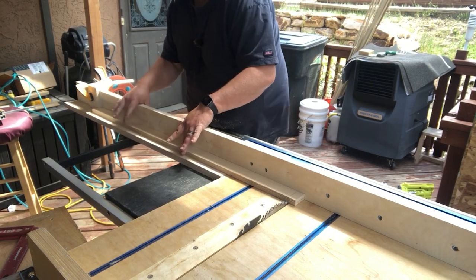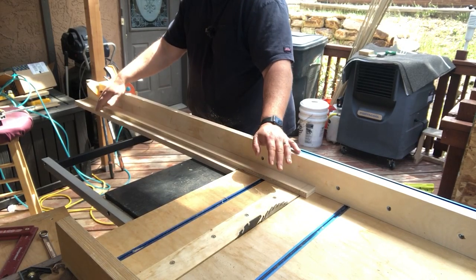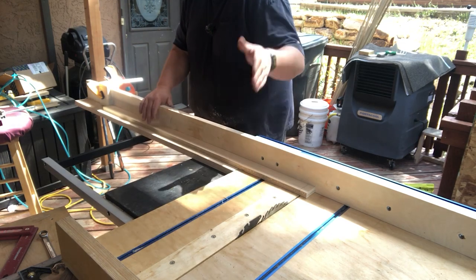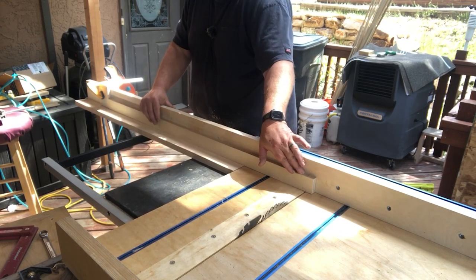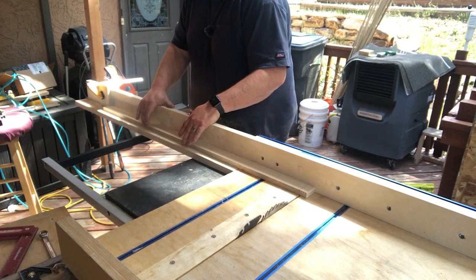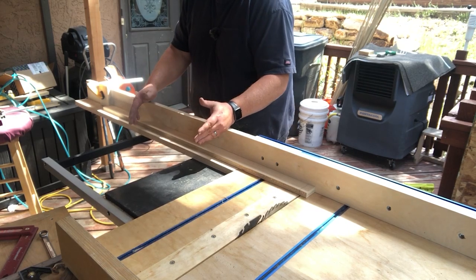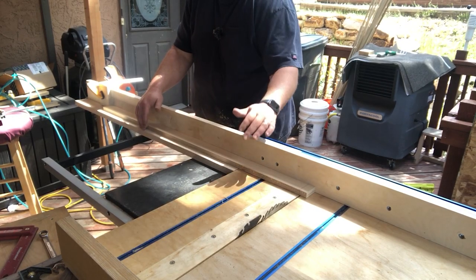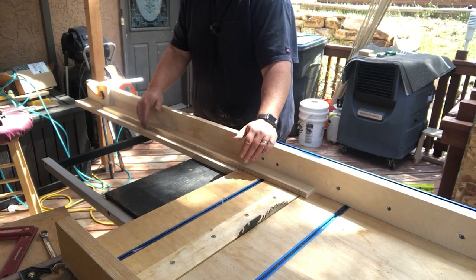So what I can do is make the first cut, then swap out the board. I don't have to mark any more boards because this will give me my exact cut every single time — I can cut as many boards as I want to the exact same length. Most of the time that's the most important thing. You want it as close to the measurement and plans as possible, but what matters is that all the pieces supposed to be the same length are the same length. This is the best way I could find to do it. Honestly, I'm amazed it took me this long to come up with this — it makes it so much easier.